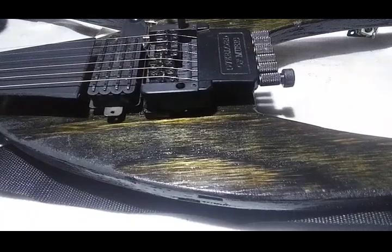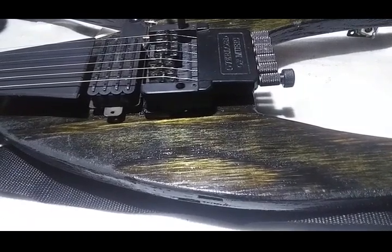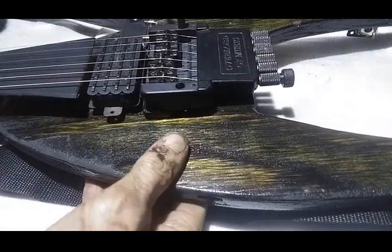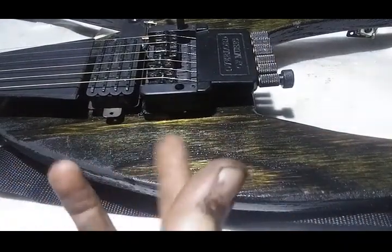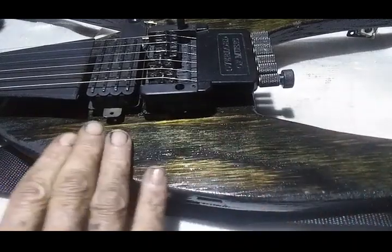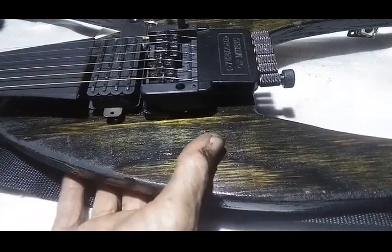I ended up throwing away a plastic spoon and a trash bag — that was it for disposable application materials. Poly is pretty much the least expensive clear coat option out there. I don't brush it on; I either rub it on with a piece of paper or, this time, I poured it on. Pouring it on shows promise — it could always be sanded down and polished and probably come out looking as good as any other poly finish.